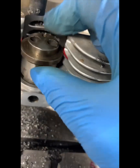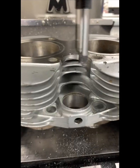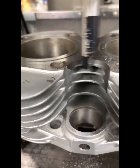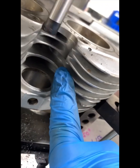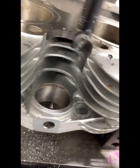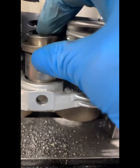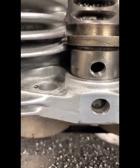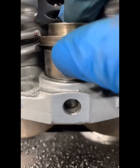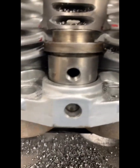We've got some red dye. Let's put it in here and scratch it up so we can see where it's touching. See a little spot right there, spot right there. So we're milling the top portion there — right at the bottom, that's where we're going to have to open it up on both sides. We'll keep running it down. So we removed material there and there — let's see if it'll fit. Now we've got clearance issues down below, so I'll use the carbide cutter and focus on those areas. We'll put some dye there, see where it's touching, and then open it up.